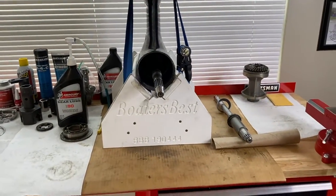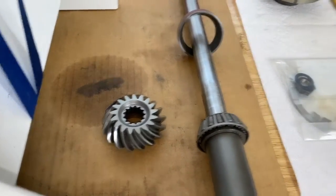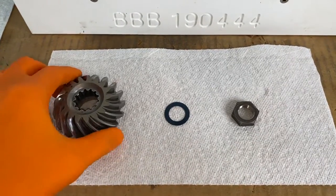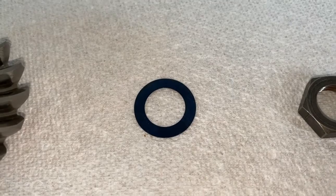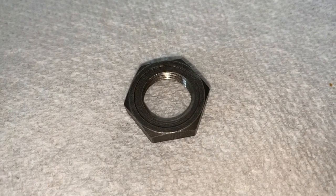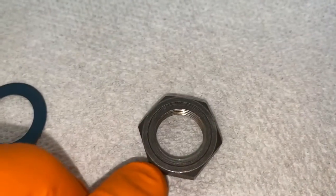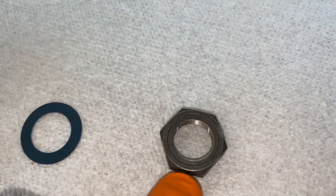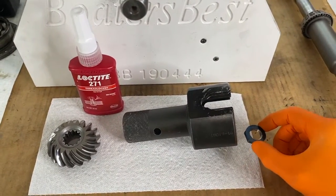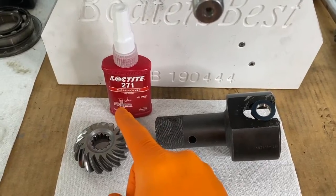Taking a step back and making progress, what we'll do next is install the drive shaft and pinion gear. Here is our drive shaft and bearing, the pinion gear, and the pinion gear nut and washer. Pinion nut and washer have been removed from the package. On the left-hand side is the pinion gear, the new washer - do not ever use your old washer - and then the pinion nut. The nut has a machine groove or shoulder engravement on one side. I'm going to grab the pinion nut adapter tool and apply Loctite 271 thread locker on the pinion nut thread.